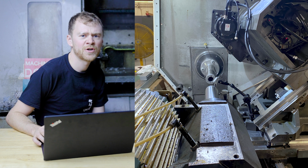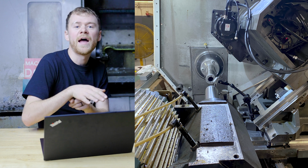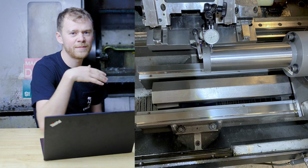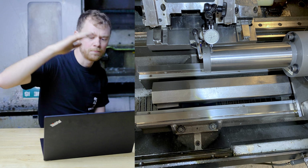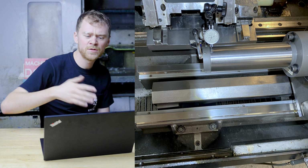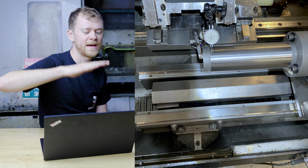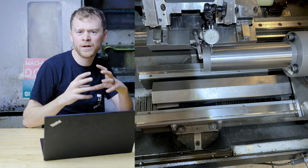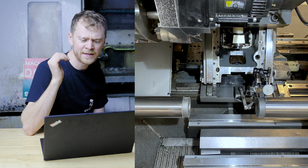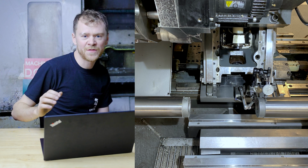You just need to be sure that your main is flat, straight, square, true, and then we're gonna do the same thing to the sub. And I have a process that I think makes it go a little easier. Just put the tailstock or sub spindle on there, and the first thing to do is to get it straight to Z and to get it flat. Don't worry about concentricity to main, okay? And you can do that with two indicators, generally easy. And if it's low, we're not gonna worry about that to begin with.